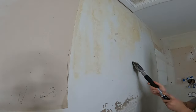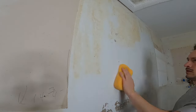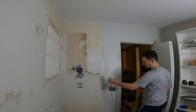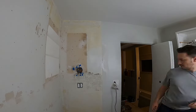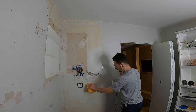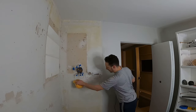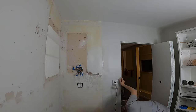After I removed all the glue, there were quite a few spots that I had to re-mud. Excluding the previously mentioned drywall damage, in areas where there was paint over mud, it wanted to pull a layer of paint and maybe even a layer of mud off with it. Once I figured that out, I started to use the sponge around joints and that seemed to help a lot more than the scraper. Might not be a sure thing, but I would definitely err on the side of caution, unless you're really good at mudding or you enjoy it. I am not good at it and I don't enjoy it, so anything to save me mud and drywall work is just better off.